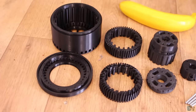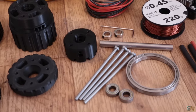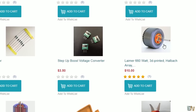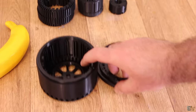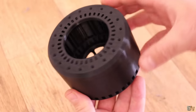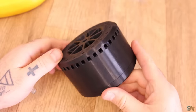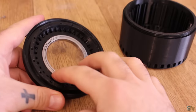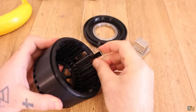We start with all the parts needed to mount this motor. You have a full part list on Christoph Lehmert's channel with links below. We start with the printed parts — go to Makezine website and download the parts. We have two main files for the motor outer part. These parts have a thread so they can be screwed together, which is a pretty nice design. They also have holes so air can flow and cool down the winding inside, because under high power this will get quite hot. The small part has a space for a 62mm bearing, and the big outer part has spaces for magnets inside.